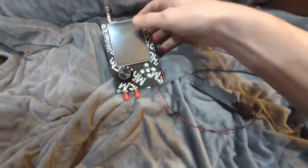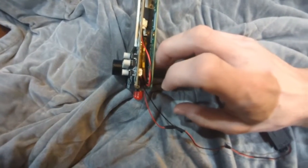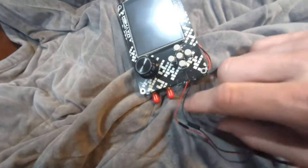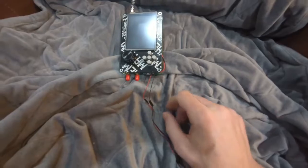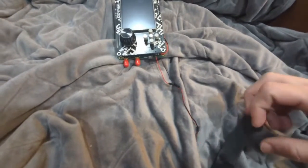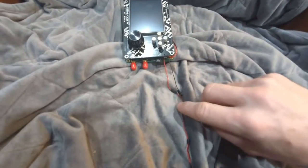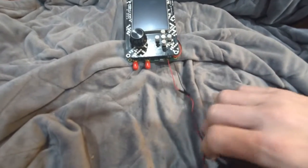Let's talk more about how we're going to create this speaker. There are two wires attached to the clip in the Porta-Pack — a red positive and a black negative. I took an old laptop speaker, twisted the wires, tested it, confirmed it was working, then soldered it together and did a base wrap of tape. I'm also considering shrink tubing to clean it up.